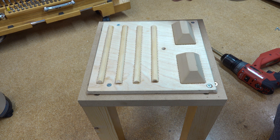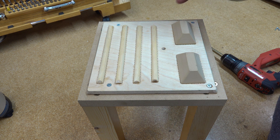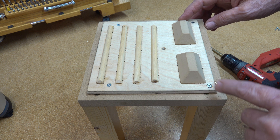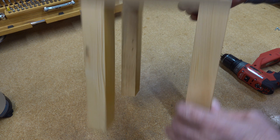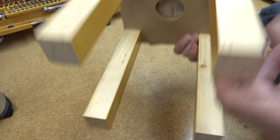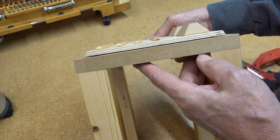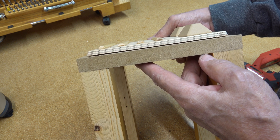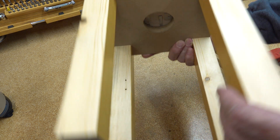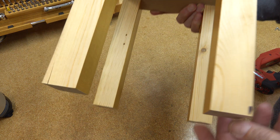Now you're going to wonder about the holes - why are there so many holes? Because I only have a regular vacuum cleaner. I need the rush, once I close this off, to be as fast as it can be before it cools. The faster your rush, the better the chances are you'll have a good vacuum form. This piece is not sitting on top of screen, but something like screen. Those are just a whole bunch of aluminum spacers - real thin spacers - because I wanted this side gap to be as thick as it could possibly be to let air out. If you use regular screen, air won't rush out those edges. I'm looking for the fastest air rush you can get, so the air can move around and get between each other quickly. Screen just slows down your air movement.